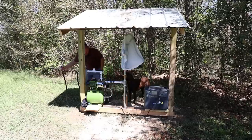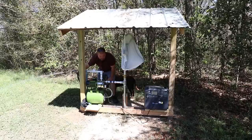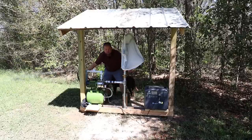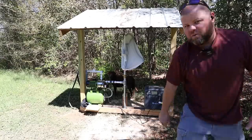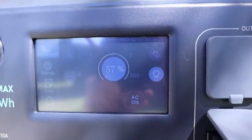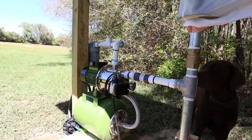The pump is under pressure, so I'm going to run some water and listen. It started up no problem. Pulling 908 watts — but it's the initial surge that well pumps have that typically trips out most units. We're now at 888 watts output. We can very easily run a one-horsepower well pump as long as it's 120 volts.